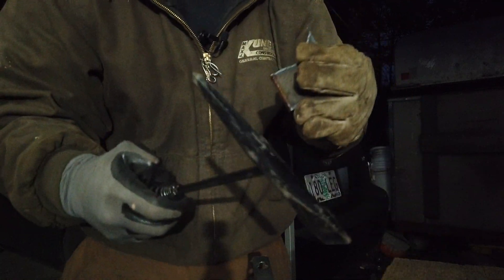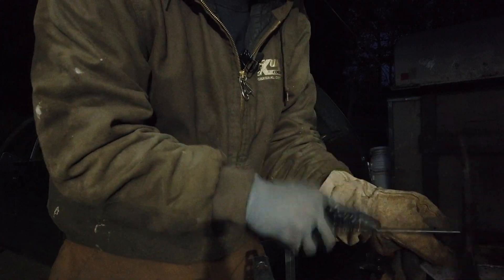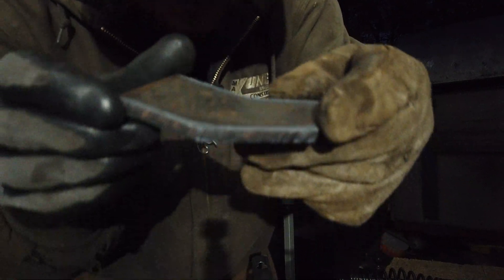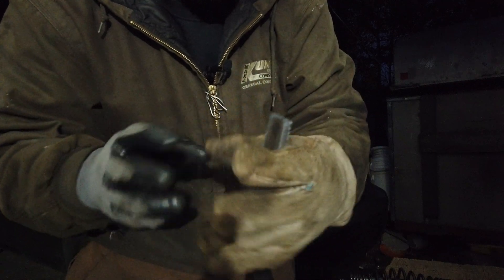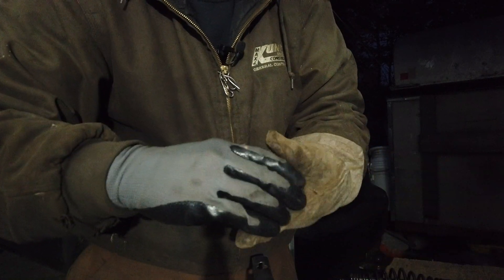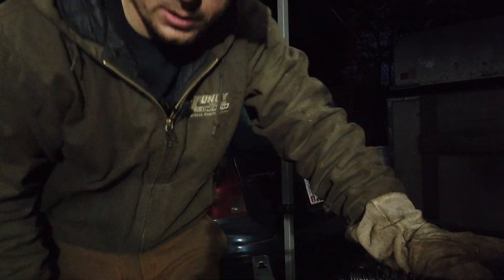This glove is worthless — this is the glove I hold this in. You take a chipping hammer to chip this edge, and there you have it. This edge is fairly clean. It's not bad — again, it all depends on how steady your hand is. See how the kerf is more or less 90 degrees, give or take about five degrees. These two pieces right here are exactly how I need them for the project I'm working on. The kerf is 90 degrees — it's V-shaped but it's a very narrow V.